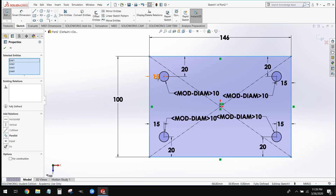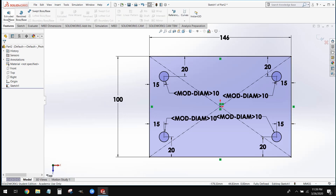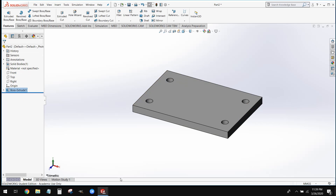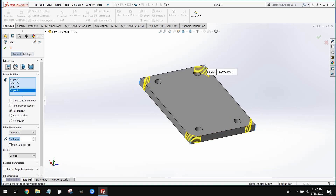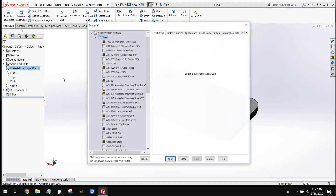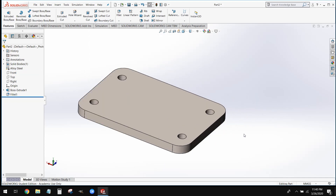When we're done, we go ahead and extrude this to a height of 10 millimeters. Then, just like we did with the bracket, we're going to use our fillet tool with a radius of 15 to round the corners. We're also going to set our material to alloy steel and save this part. If you have any questions on these parts, feel free to reach out. We're going to continue this in the next video — have a nice day.